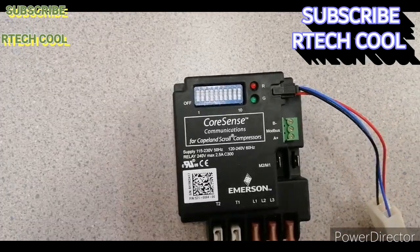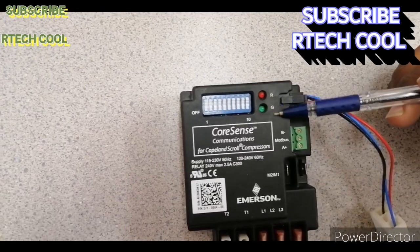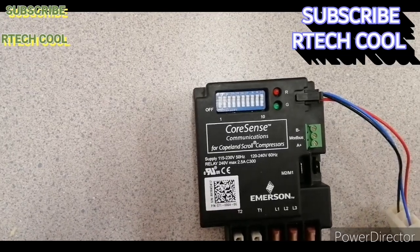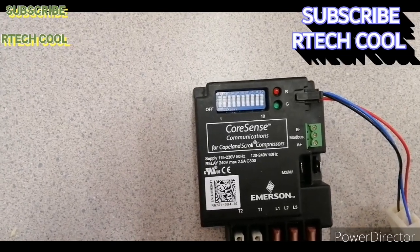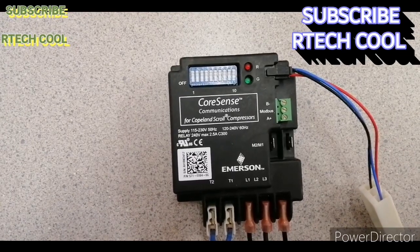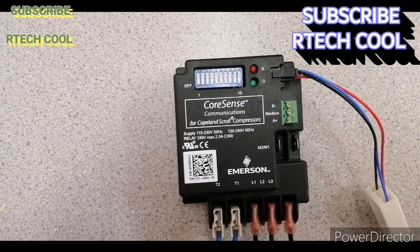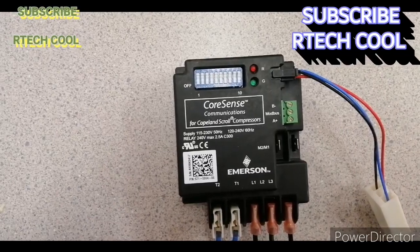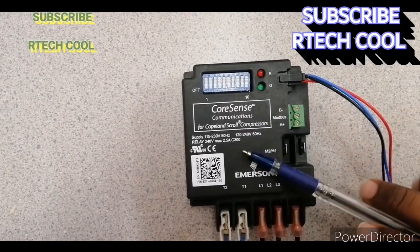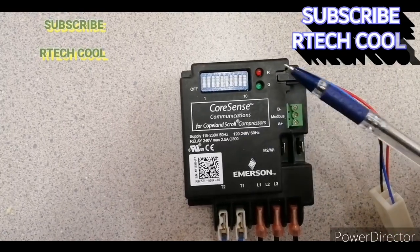The M1/M2 series connection is for HP and overload protection. Regarding the indicator lights: if there is a green flashing code — one flash, two flashes, three flashes — this means a warning. The green light flashing gives you warnings about missing phase, low voltage, or other issues. A red indication means the compressor is tripping — the module has detected a major problem.